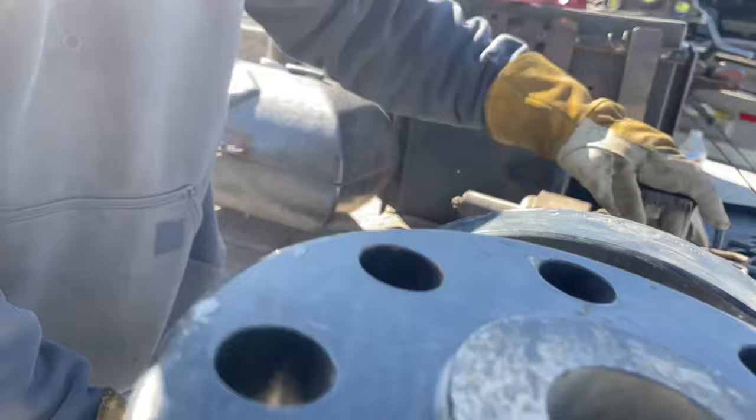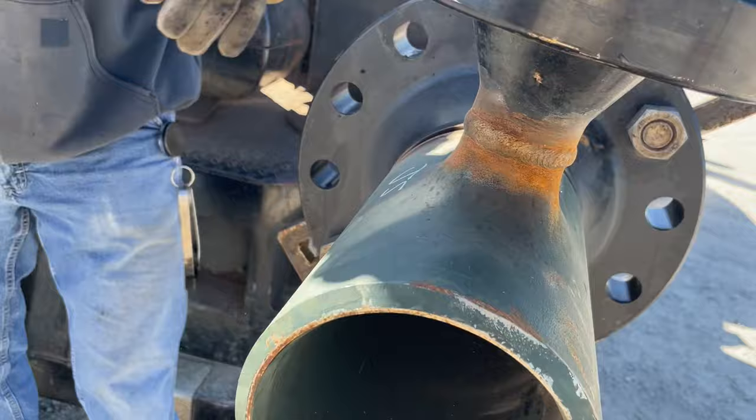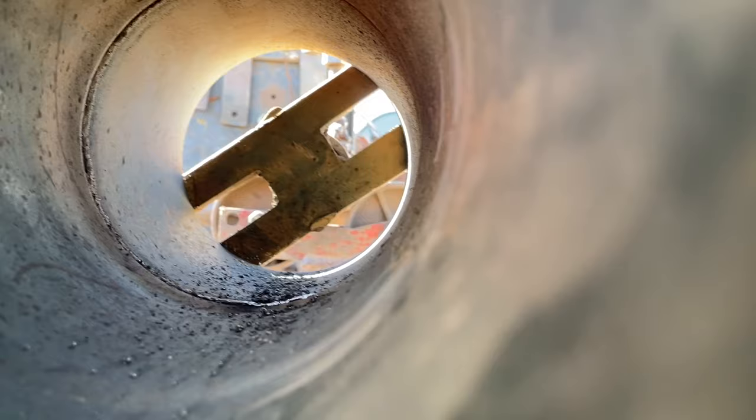Way more bead than I wanted to put in it, but I think when I told him to grind, he ground the whole bottom thin. That's okay, it's part of it. We're not used to grinding holes in pipes. Now we're gonna hot pass that hole. Turn me to six. With a 5mm, you don't want to stay on it long if you know it's thin.